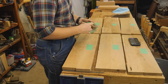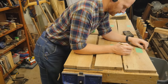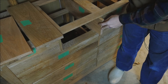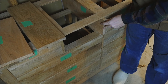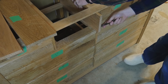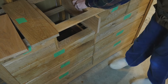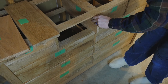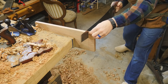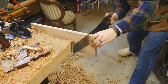After they're all clamped up, I can lay them all out and figure out where I want them to go on the dresser, then mark them. From this point on, all boards are marked and labeled so that I have a side, a face, and a back for every drawer slot. I want to make sure they all fit and size them precisely to their opening — marking each board to its specific drawer slot. I also did a separate video on piston fitting the drawers if you want more detail.